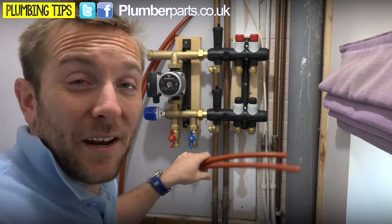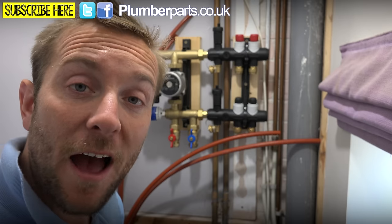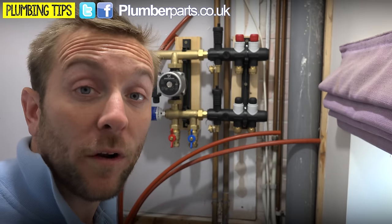If you're installing in a really, really big house, where there are different rooms and all that, you'll have to tape up and mark out which returns and flows go to which, okay? So then you'll know later on, and then you can actually mark the manifold accordingly at the end of the job.